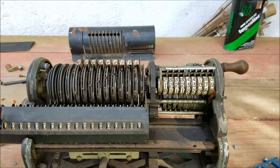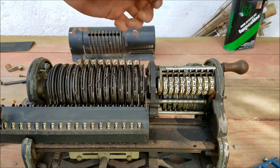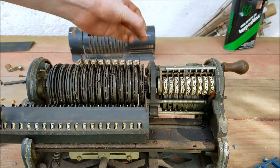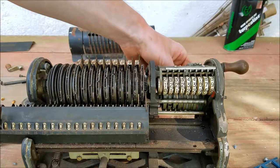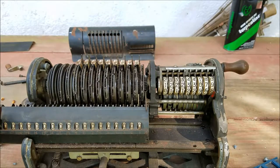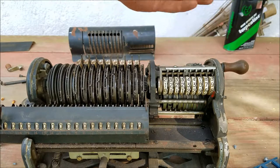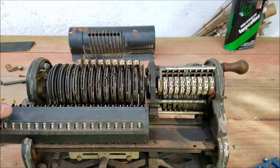I'm not really going to be too concerned about it. It wouldn't work in that state anyway because these little levers are what move back and forth to affect the tens carry, and they were stuck in place because the hot pot metal had expanded. So I managed to chip that out to get this moving, and the reason I had to get it moving is because the carriage was stuck in place.